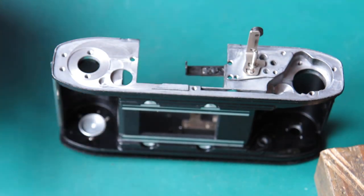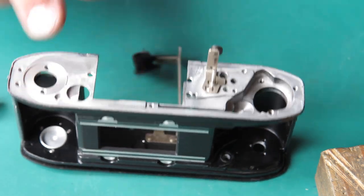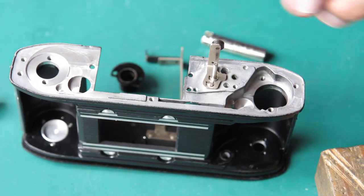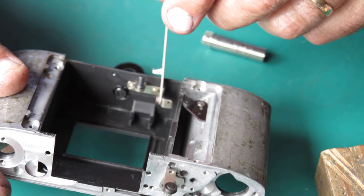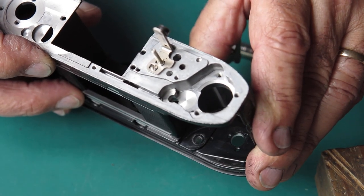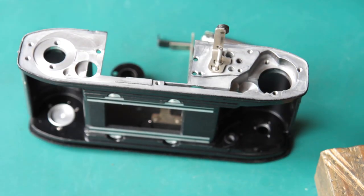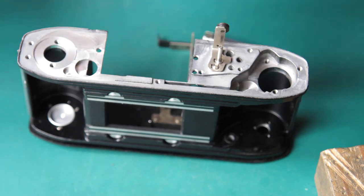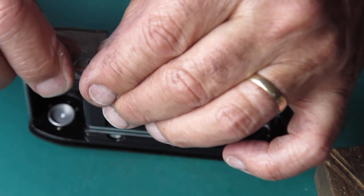At the top of the camera I've got my Film Rewind shaft. I'm looking at this lever here and I can see that it runs off at somewhat less than 90 degrees — I think that might need a little adjust. It's anyone's guess what abuse this camera suffered. So taking some synthetic grease, I'll lubricate the bush here for the Film Rewind shaft.